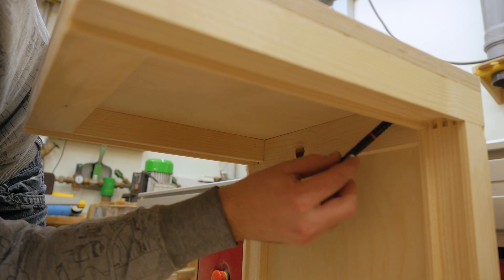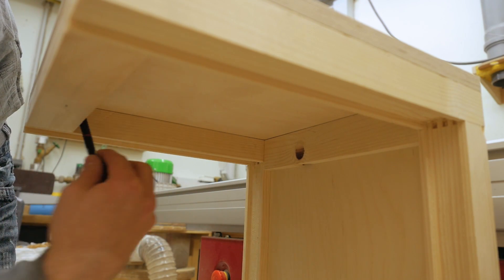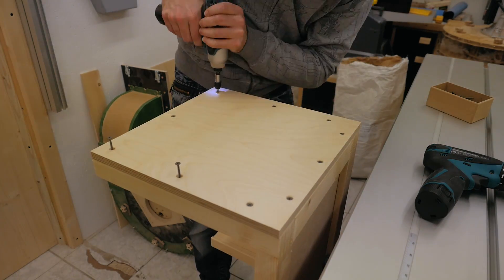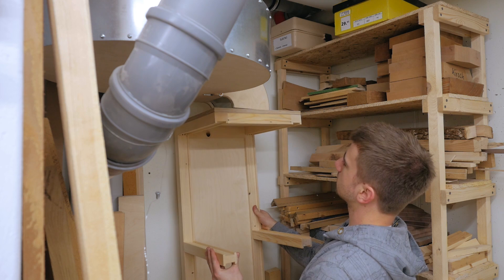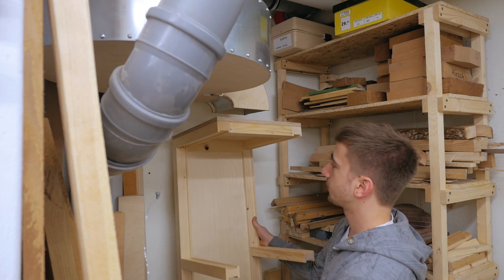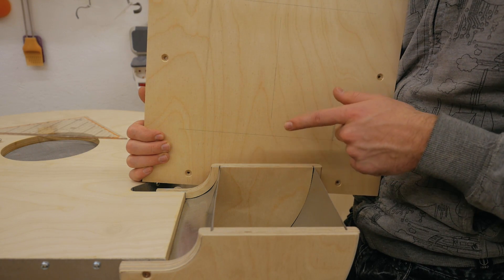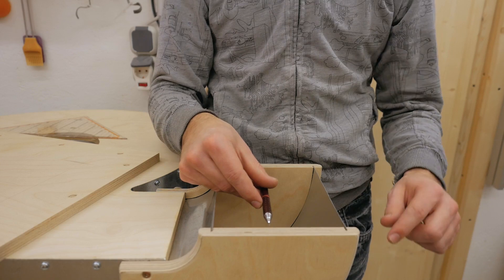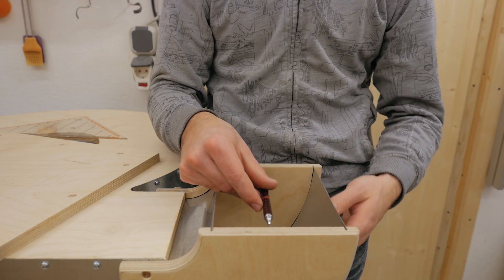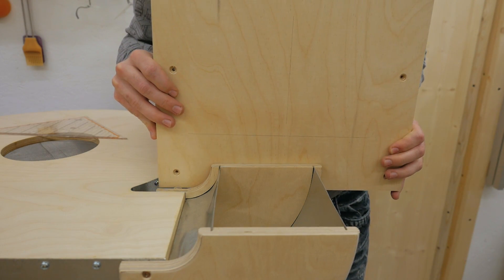I'm now marking the inner perimeter to locate screw hole positions. This gets mounted to the blower housing, but that's easier to do with the blower housing on the workbench. I want the airstream to enter the filter box in the center, so I shouldn't mount it centered here, because the majority of air exits the blower in one area due to the curvature of the transition. So I'm going to mount it a little bit offset.